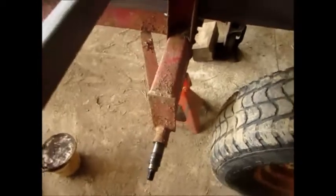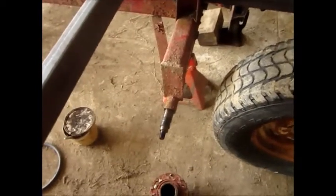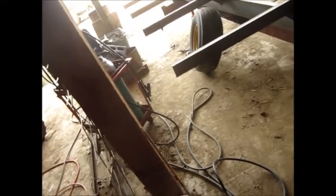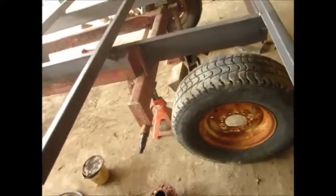Working on the back — got the front done, all the steering and that stuff. Working on the back, took this one apart. There ain't enough grease in there to say so. That bearing in the front — this side hub — is not the greatest, but it should be alright for now. I repacked it full of grease and put everything back together.